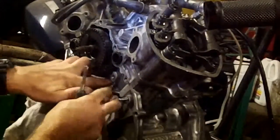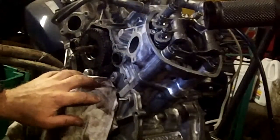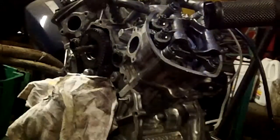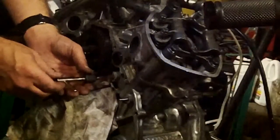I don't want any aluminum shavings coming out, so I've coated the tap in grease. Hopefully I'll catch most of them, but I'll be vacuuming it off and blowing it off with air after that. So I'm just going to tap in.